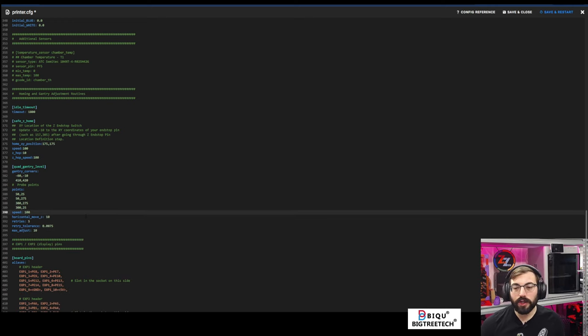With this mount, I don't like running an accelerometer test with it mounted on the extruder because it's not that rigid. You really want to use a proper mount. Let's go to the alternative worm mounts for Dragon Burner and grab a PCB mount. We'll grab the Orbiter V2 long mount — Dragon Burner V2. This'll give us four mounting points instead of two, which is more rigid and would allow us to do input shaping without having to use a nozzle-mounted ADXL. It's really convenient to have an ADXL built into your tool head.